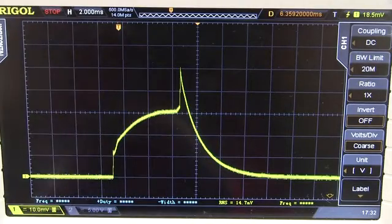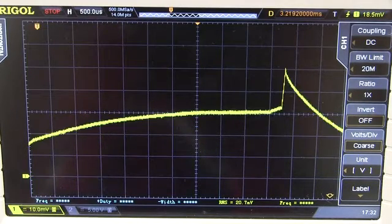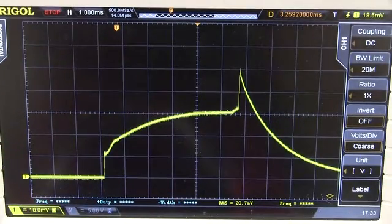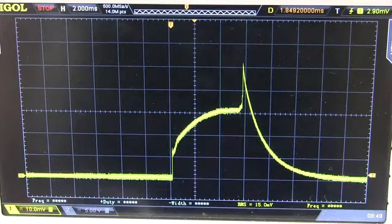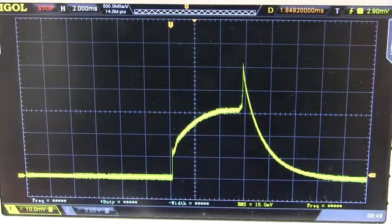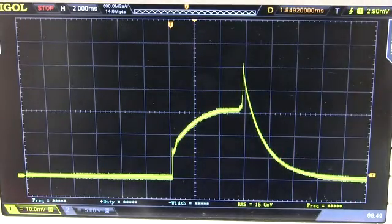We can drop down to a 100 ohm resistor — still 10 times larger than the MicroCurrent — and we get it to work. But look at the tapering off of this waveform: there's no high-frequency content in there at all, because that 100 ohm resistor is killing all the high-frequency detail we could see with the MicroCurrent. We're down at 10 millivolts per division here versus 100 millivolts per division before, so we're further down in the oscilloscope noise. Reduce the resistor further to get equivalent gain and it's just not going to work very well at all, whereas the MicroCurrent has a precision ×100 amplifier right at the current shunt.